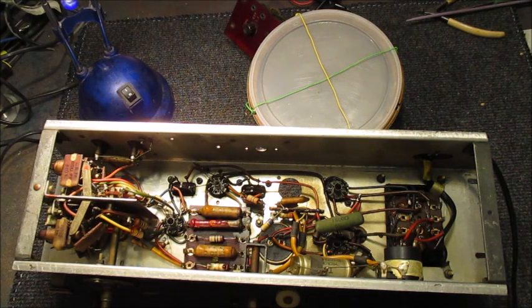In this instance, I'll get this radio working. I'll test and replace defective components as I go along through the entire circuit. Once I'm content with how this radio is performing, I'll strip it down to a bare chassis and begin the usual long-winded task of cleaning and reassembling. Once all that is complete, should an IF realignment be warranted, I will realign the IFTs and local oscillator.